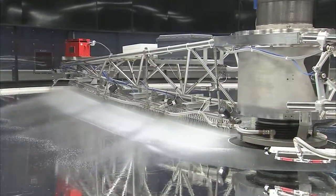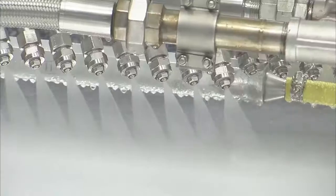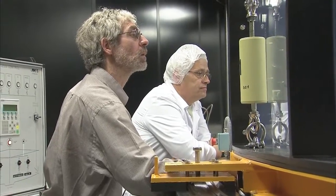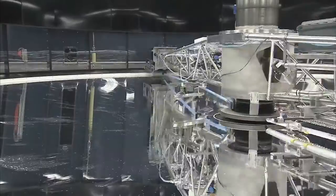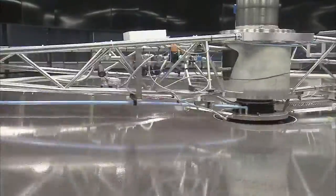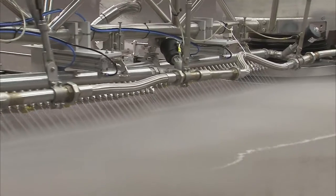The washing process begins and a giant purpose-built sprayer arm rotates just above the surface of the mirror. Ultra-pure water and chemicals are used. Under the critical eye of the optical engineers, the machinery does a flawless job and the operation proceeds smoothly. In the next stage, acid is used to remove the old aluminium coating. The real amber colour of the dish appears — the mirror is made of special ceramics that don't deform under temperature changes. Again, the mirror is rinsed intensively to provide as clean a surface as possible. Once done, all the liquid is pumped out and the mirror is ready for the vacuum chamber.